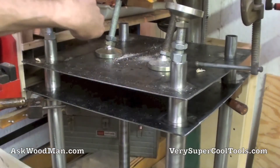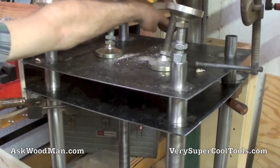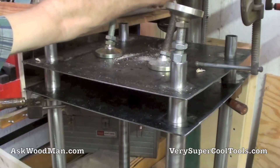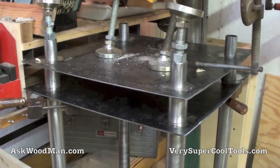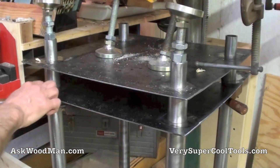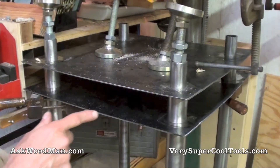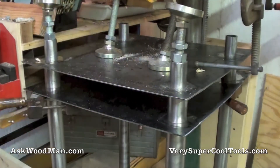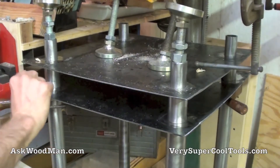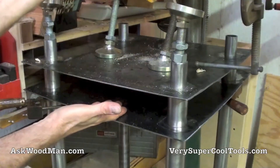I'll go 2 inches and put a half inch, alternating on both sides. I'm going to connect 3 on the top, then put one on the bottom because I've got to make a cutout back here to accommodate the yoke off the up-and-down mechanism for the drill press. Down here I'm going to put 4. Both spots are going to be tool trays — there's no reason they can't store stuff. With that lip around here it's going to be a great place to store things on my drill press.